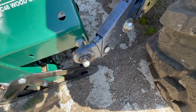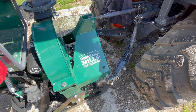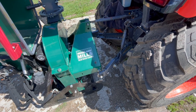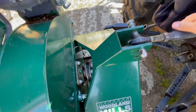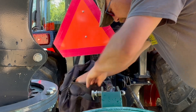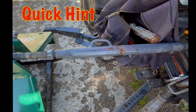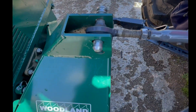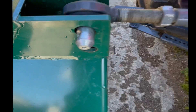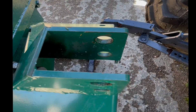One thing I love about the LX is its adjustable links — makes taking the three-point attachments off and on much easier. Still not quick-hitch quick, but definitely better than the BX little turnbuckles. Quick hint for taking off three-point attachments: you can see the pin is up against the front, so if you extend the link, it evens out and the pin comes out just like that.